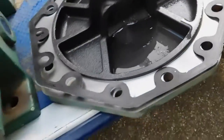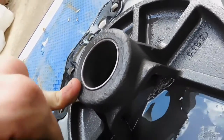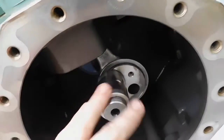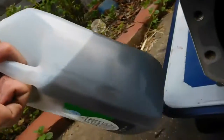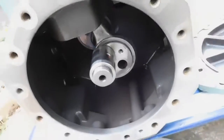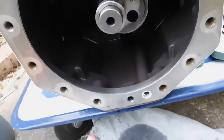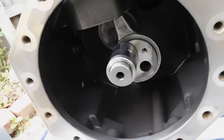I don't actually know if these use white metal in their bearings. White metal is something I see quite a bit working on the larger compressors - the big reciprocating and screw compressors all have white metal bearings because that's the bit that wears. If it's flogged out you'll see little bits of white metal particles in the oil. The oil here is pretty dark gray, so it may just be worn out. These things don't necessarily throw their rods and catastrophically kill themselves when they fail - they may just stop pumping.